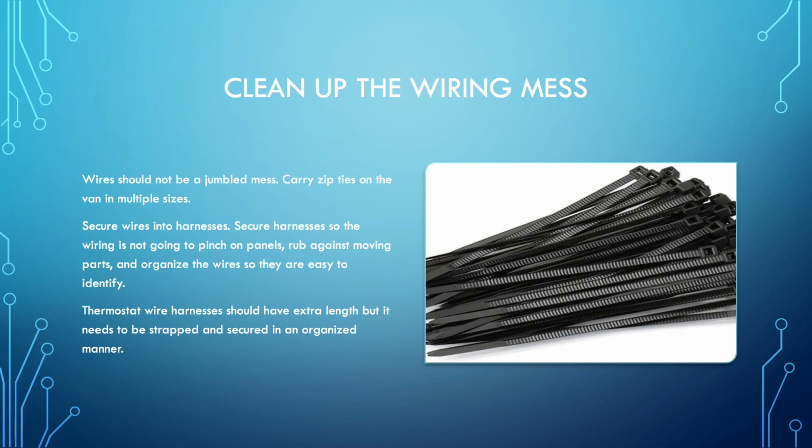However, for thermostat wiring, you have to have the excess harness. That is necessary. You want to have some extra in there, but you don't need 2 to 3 feet of extra wiring harness inside the air handler. Trim it back. It's completely unnecessary to have that much wire in there. Have an appropriate amount. A lot of times people will twist it around a screwdriver to create something of a phone cord look, so the excess is not just this obnoxious harness hanging out inside the compartment. Most of the time you see that at units outside, where they did the accordion look to it.